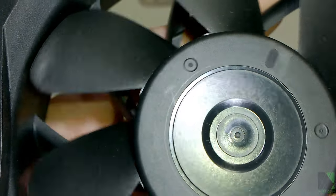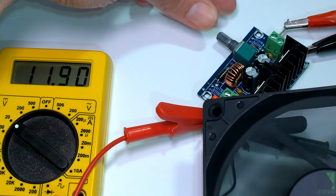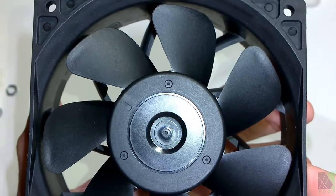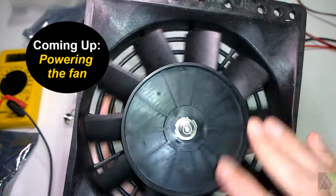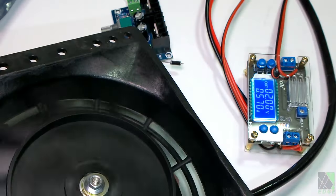This season, I will also be using brushless DC fans to cool my sheds. If you want to use this type of fan, I suggest avoiding the cheaper computer fans. Instead, look for more powerful and durable server and mining fans with ball bearings. Since those fans are smaller, you might need to use more than one to get good airflow. A typical car radiator fan can push hundreds of cubic feet per minute, or CFM, of air as they are quite large.